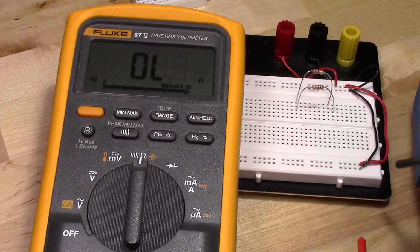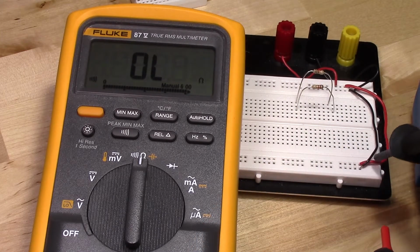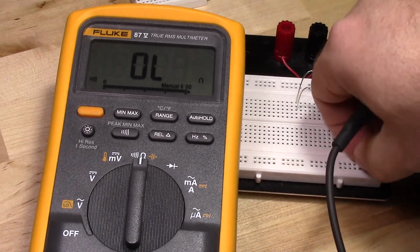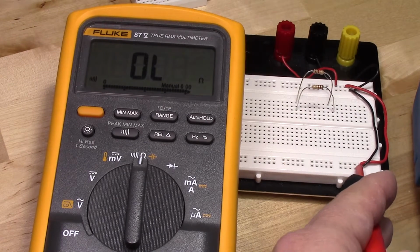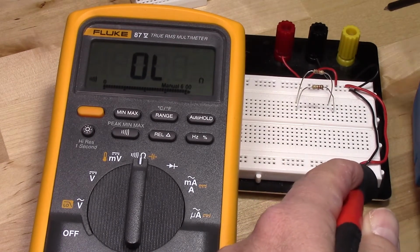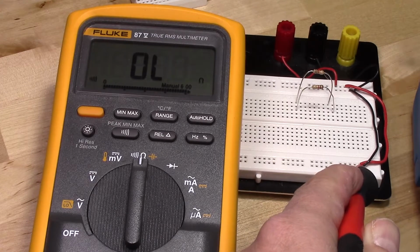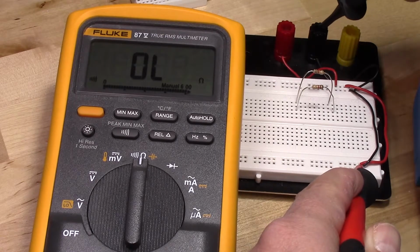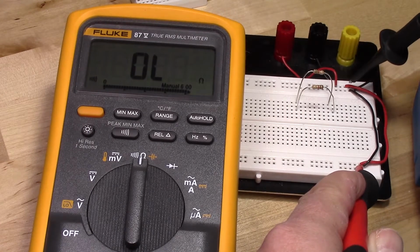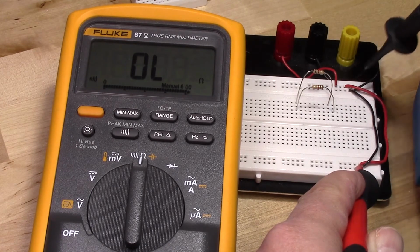So let's say, hypothetically speaking, I'm not too sure if power is actually going through here. So I can connect, let me see, pull this, I should use the ground wire. So if my circuit's not getting power, I might want to first disconnect it from the power. Then I can actually go in and measure continuity. So in this case, I'm measuring from the binding post, and it's passing through. So here, it is a complete circuit.